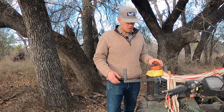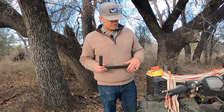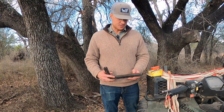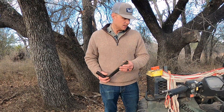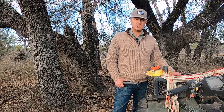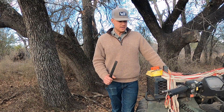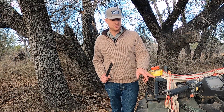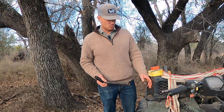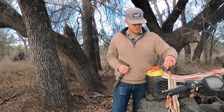To start off, this main arm basket is one-and-a-quarter inch tubing running all the way through here, and this arm slides into it. The arm itself is one inch tubing. I did purchase this basket from that manufacturer, but I think any basket you have can be made to work if you weld on some one-inch tubing to use as a sleeve to slide into.